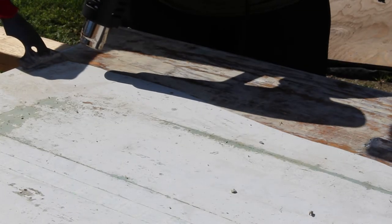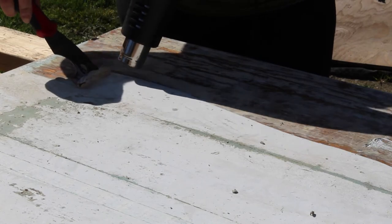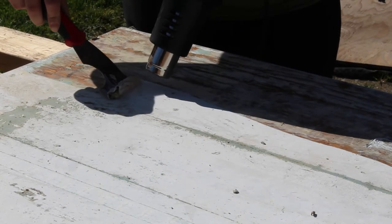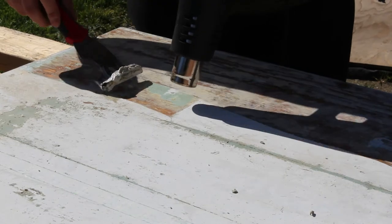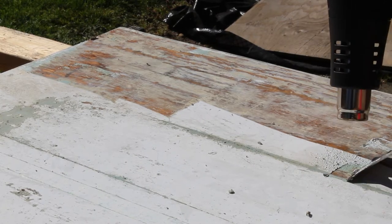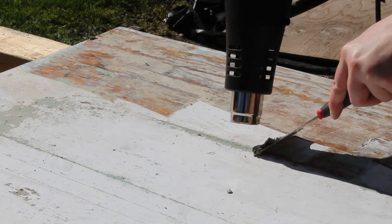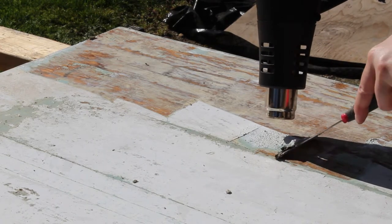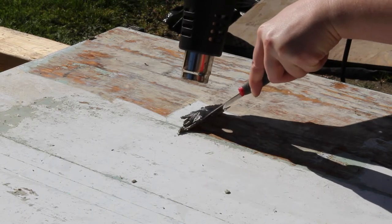The first method I'm going to show you is using a heat gun — this is actually the way that I prefer to remove paint. You're just going to hold your heat gun about an inch or so away from the paint, and then with a metal scraper, once it starts to bubble up, you're just going to slowly and carefully scrape off the paint. Make sure your metal scraper has a beveled edge and not just a flat blunt edge — the blunt one can gouge into the wood. Another reason I prefer the heat gun over a chemical stripper is that both options are not going to completely remove the paint either way, so you're still going to have some residue left over.